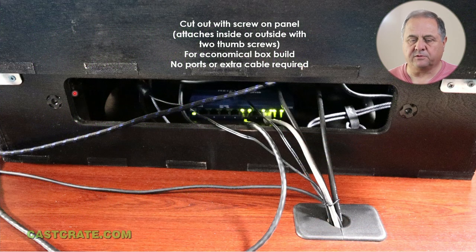So this is a close-up of the cutout. You can see there's two quarter-20 threaded inserts here. You can actually mount the boiler plate to the back, or to the front or the inside, depending on how you want to do it. We designed it originally to put it on the inside, and that's why the inserts are on the outside. These are the removable hinges — those are standard road case removable hinges. The lid is held on by the two struts, but if you detach the struts they pop off and you can actually lift the lid off and lay it flat if you wanted to.